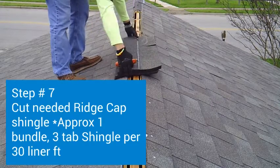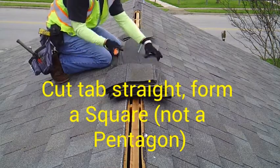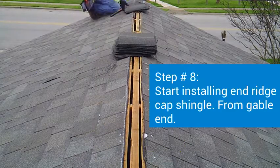Step 7, cut the needed ridge cap shingle. Approximately 1 3-tab bundle of shingle covers about 30 feet. Cut in straight squares, not pentagon. I will explain why in a later video. If you need to know, please comment below and I'll answer that for you.